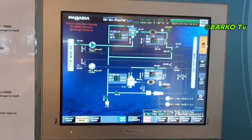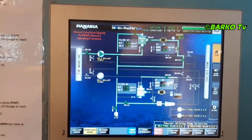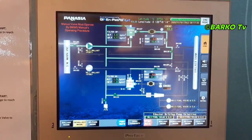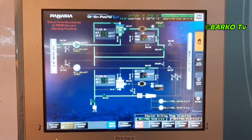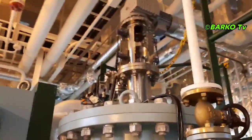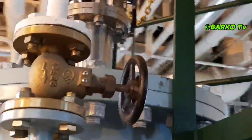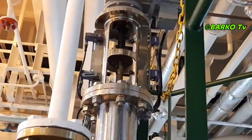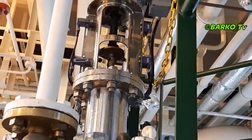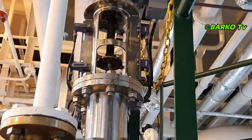There is another automatic drain. This filter has a differential pressure sensor. If the differential between inlet and outlet is too large and reaches the set point, it will automatically clean up — flushing. The filter is auto backwash. This is the filter. There is a motor at the top and there is a lever — that lever is connected to a nozzle inside. There is a nozzle inside the filter that will spray at the strainer. There is a limit switch at the top and the bottom. In the next video I will show you the structure of that filter.